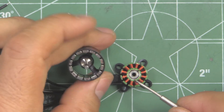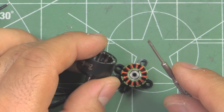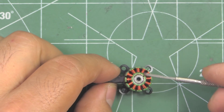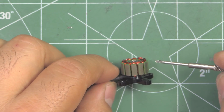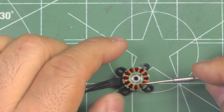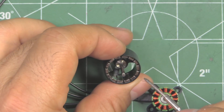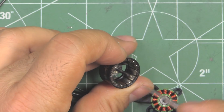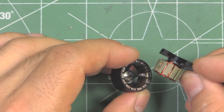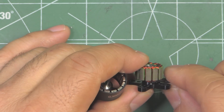It's going to be interesting to see how it compares to the 1407 in terms of maximum thrust. It's kind of hard to quantify motor response with standard testing hardware - you'll need better hardware to find that out. So it'll be interesting to see when people start using it whether they notice any improvement in response, going from 9 poles on the 1407 to 12 poles on this motor. Also, the magnets are arc magnets, which is great - it helps maintain an even gap from magnet to stator face.